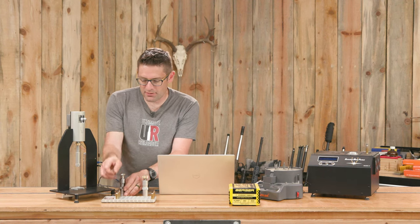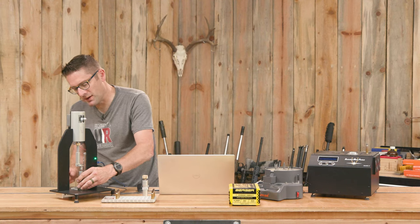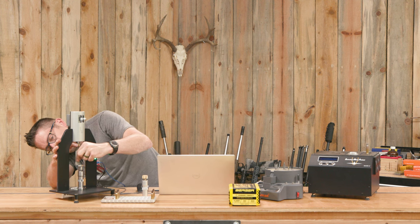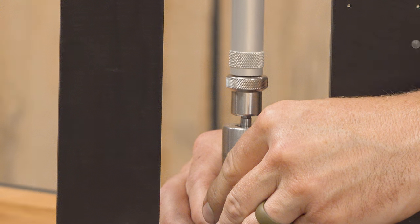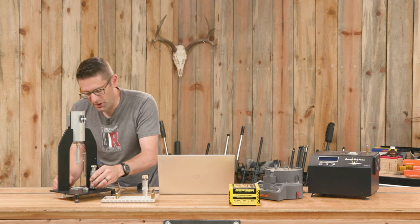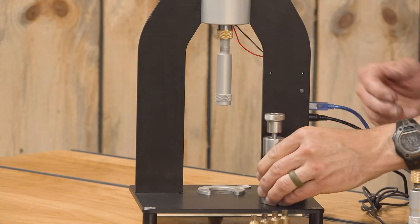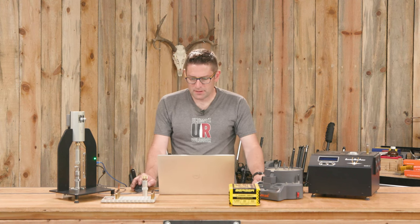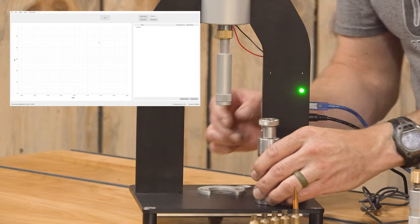For the height, we need to get the entire assembly in here. We're going to put this together — that's going to pop up to the level it will be at. Start with a quick RAM adjustment; we want just a little bit of a gap up there, about a tenth of an inch. As long as we have a good gap, the exact gap is not super critical. Then we take that assembly out and we need to do our Find X0. Okay, empty die goes back in. We've got a new session created. Find X0. We've got our X0.